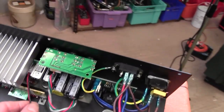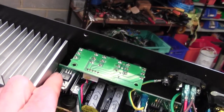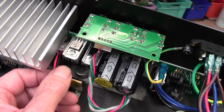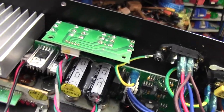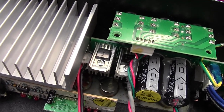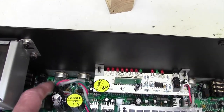All that remains is to remove the speaker connection here which goes onto this little two-pin plug, which they've put in a position that's completely unreachable to press the pins down - you can't easily get that plug out. Great design. So I'm going to get in there with some long nose pliers to press that catch down. Makes you wonder who designs this stuff. Right, that plug came off very easily with the long nose pliers.